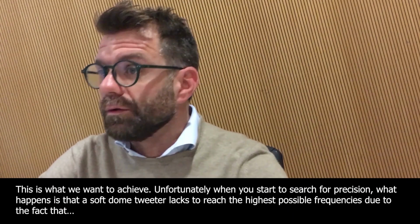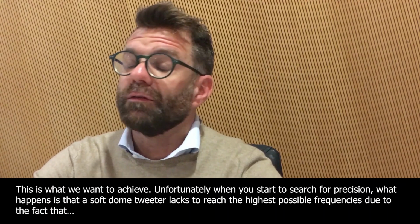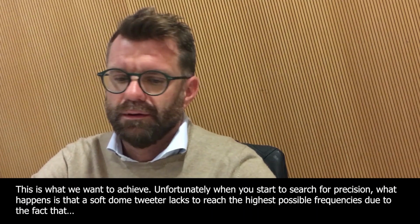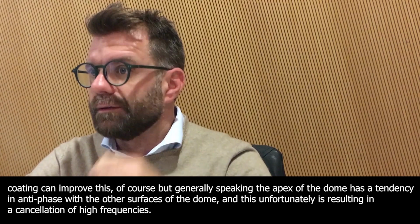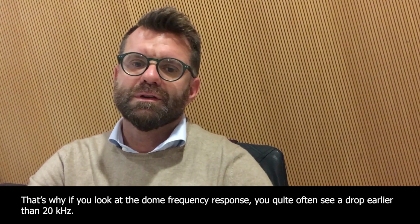Unfortunately, when you start to search for precision, what happens is that a soft dome tweeter lacks the ability to reach the highest possible frequencies. Coating can improve this, of course, but generally speaking, the apex of the dome has the tendency to behave in antiphase with the other surfaces of the dome. And this, unfortunately, results in a cancellation at very high frequency. That's why, if you look at the dome frequency response, you quite often see a drop earlier than 20K.